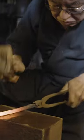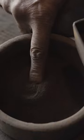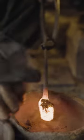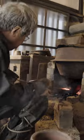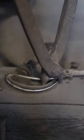Then he switches to a manual one. To make the blade, he forges a hard piece of steel. Yasuhiro uses powdered borax and iron oxide to bind them. He heats the metal once more and hammers it again to flatten it into the shape of a blade. He uses this mold to bend the handle into its signature butterfly shape.